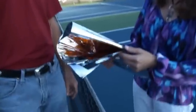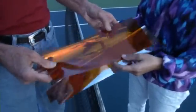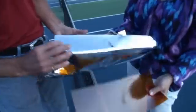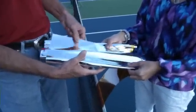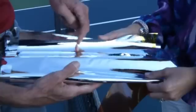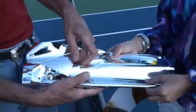You are the chief process engineer for the sun shield. Can you tell us a little bit about what Kapton is? Kapton starts out with this amber color — this is raw Kapton. After that, the Kapton goes through a coating process where we put the aluminum metal coating on, as you can see here on one side. Then we process it again to have a coating on the other side. In the end, three layers of the sun shield have the aluminum coating on both sides. The remaining two layers will have aluminum on one side with silicon coating on the back side.